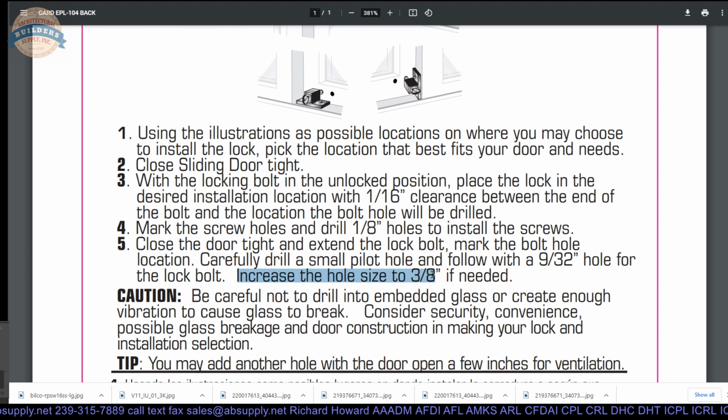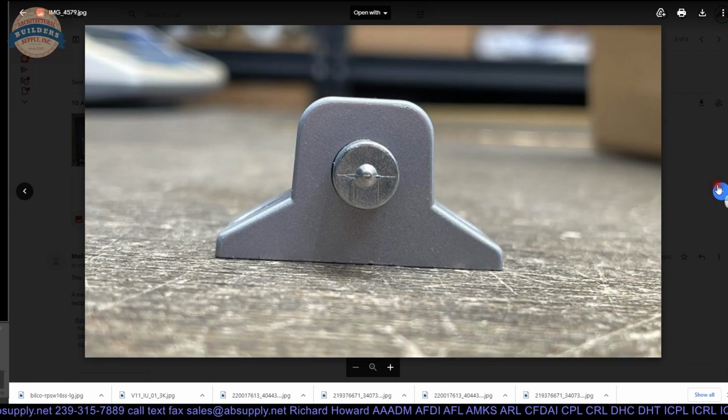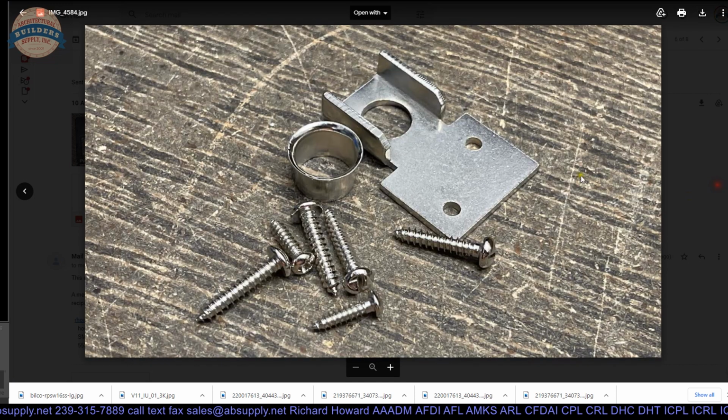And that would be a reference to that thimble strike. And I'm going to tell you the ID of the thimble strike. Pardon me, you're probably going to drill a 17/32 diameter hole for this strike, and what I mean is 17/32, about 0.53. If you're going to install this, the outside from here to over here is about 0.51.